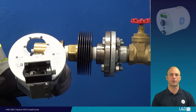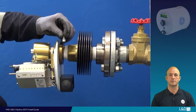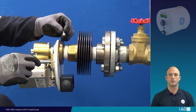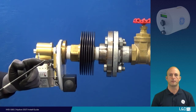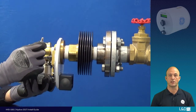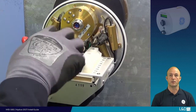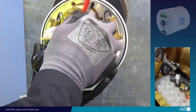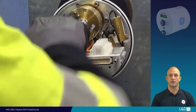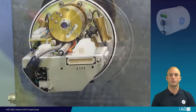Next, to install the Hydran main body with the conduit plate removed to allow cables and conduit to be fastened. Follow this method to reinsert and secure the six adapter screws. Ensure the spring washers are present before tightening. A useful tip to reduce the chance of screws falling: cover the end of the tool with a small piece of electrical tape — this will keep the screws in place during re-tightening. Allow the unit to hang under control, then insert the bottom left screw first, then insert the remainder. Only fully tighten when all screws are relocated, tightening evenly using the cross wagon-wheel method.